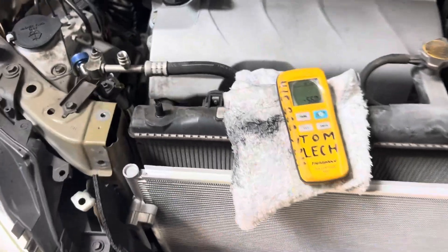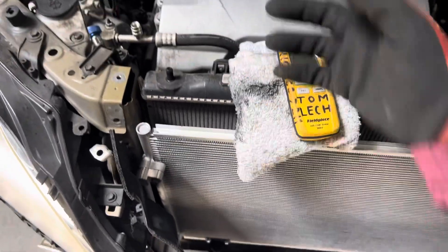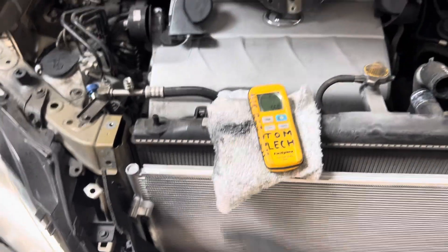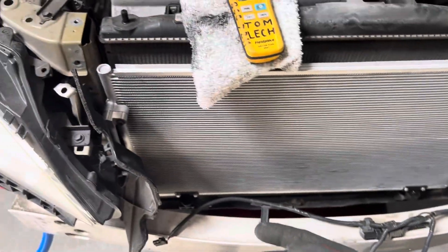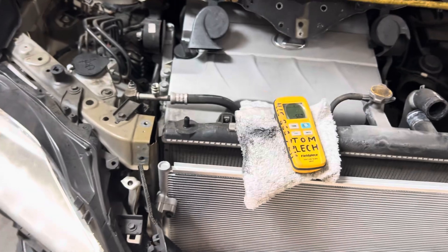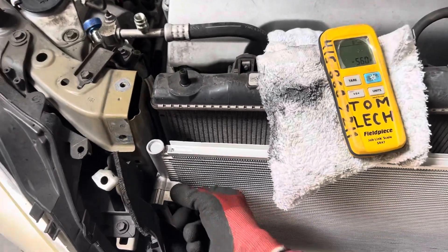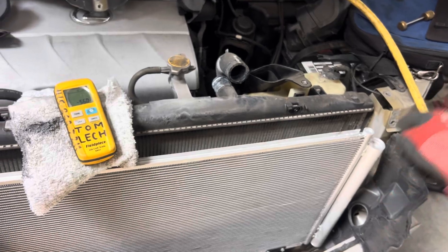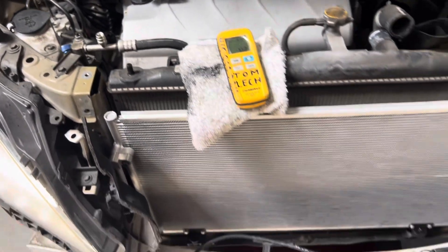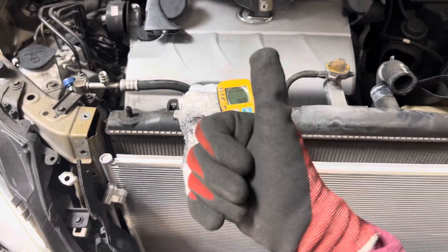When someone leaves the lines open for a couple days waiting for parts, or even worse, some neanderthal comes over with shop air to check for leaks — that's it, system is wiped out with moisture. You cannot remove that moisture with a vacuum pump in any reasonable time. And because he doesn't know if his fittings leak, he just saturated that new desiccant. Since we didn't have that happening here — we used nitrogen — we don't have that problem. See you guys.